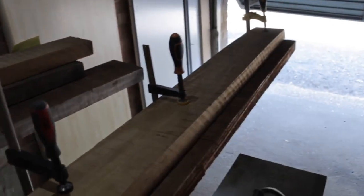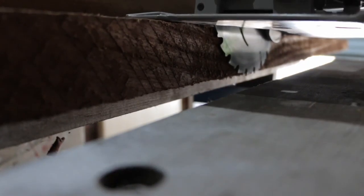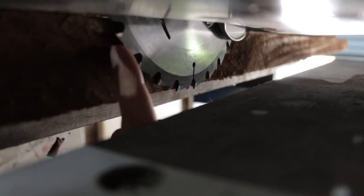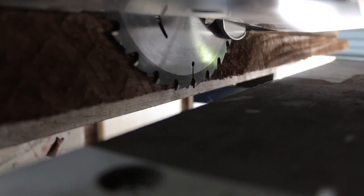It's a lot of faff to do this for every single edge but I think it's what I'm going to have to do. I've set the depth of the saw blade so that it just goes through the wood. The blade is cutting the face of the wood along with the grain. If I had it much deeper, where it comes out of the surface, it would rip the surface and splinter it. You've got to have the blade so that it's only just going through the wood and then you get the cleanest surface cut, rather than it ripping out of one side and back in the other.